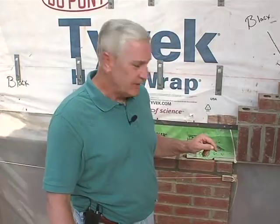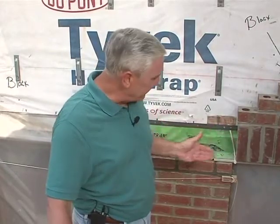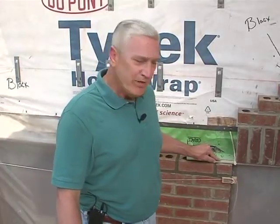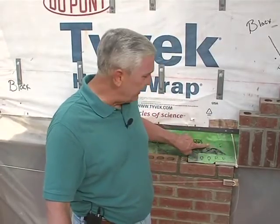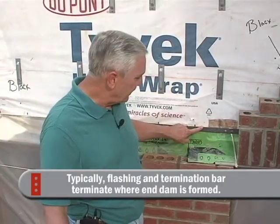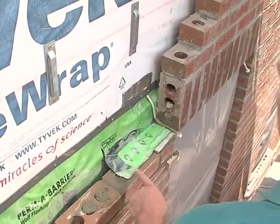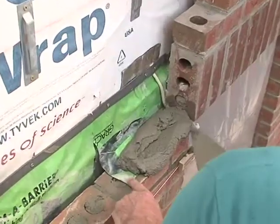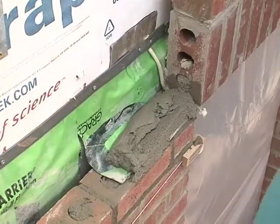It's such a simple application — the installation isn't hard. What I'd like you to see is the components first, and then how easy it is to make a little end dam in the flashing across the head of this window. As you can see, one side has been completed and we've left this area exposed. We have a nice galvanized angle iron being used as a lintel here to cross this small opening, with about a four-inch bearing on the masonry underneath, satisfying the code minimum. We have our peel-and-stick flashing in place and a little termination bar at the top so it doesn't fall into the cavity at the leading edge. I've laid a couple of brick here to get started, and I'm going to lay two more and create an end dam. We also have a rope wick here as a weeping device at the head of the window.